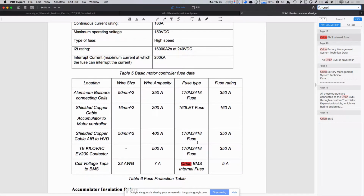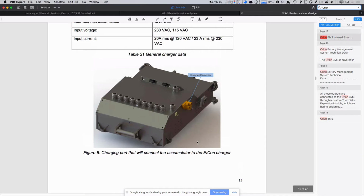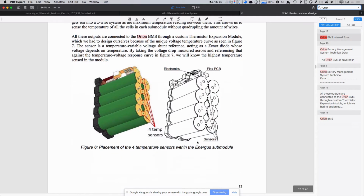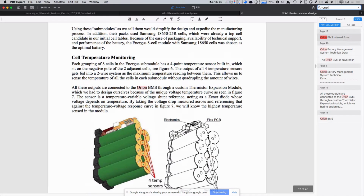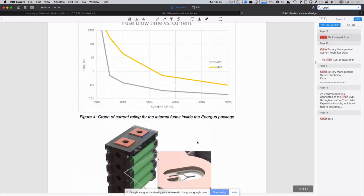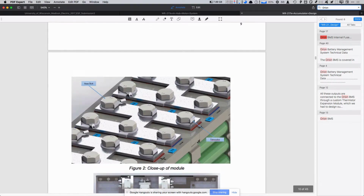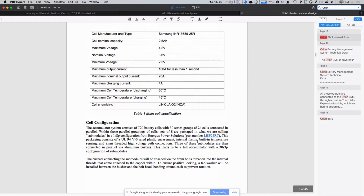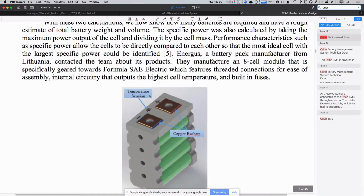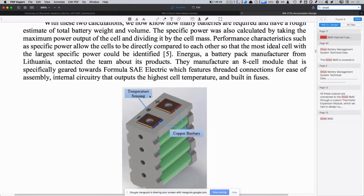And you have the bus bars that you were showing me. That would be a good place to mount the thermistors. Yep, and then just run current through the bus bars. And I think it has internal fusing, which is also nice if it's already fused. That will save you a lot of hassle in the end, because adding in your own fusing is a pain. Yeah, I'm sure.